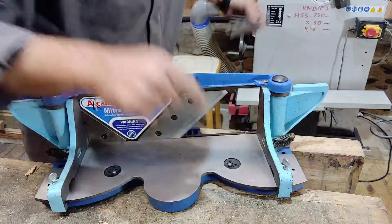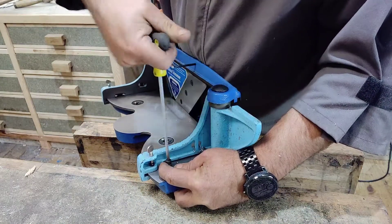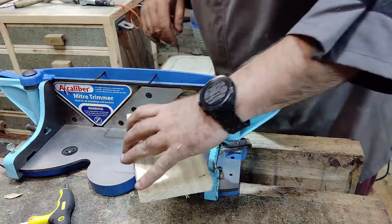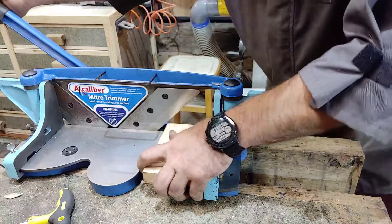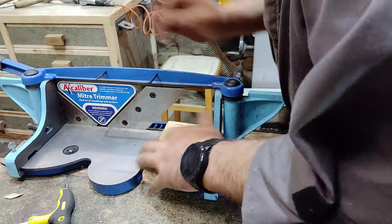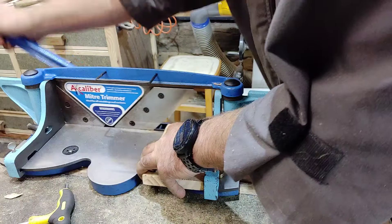So you can tighten that down so it's set at 90 degrees. But then what you do is move the cam up against it like so, and then you tighten that up. But then you can test that using the bit of wood method with your parallel piece of timber. Normally this would be mounted somewhere in a fixed position so you can use it without it moving about on you. So you place it in, make one cut, flip it over, and check to see whether that's touching all the way along. And if it's not, you're not square. And it's not square now, so I need to make a slight adjustment.